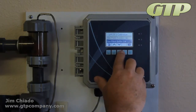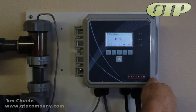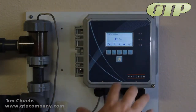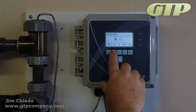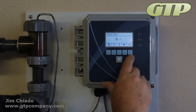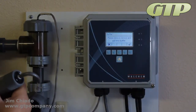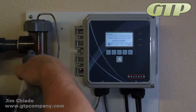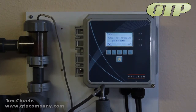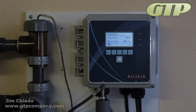We're going to do a one-point buffer. Hit return and disable the controls — I don't want to feed chemicals while I do this, I'm just calibrating. I know this one is 10, so I'm going to make it say 10. I'm going to hit check, rinse it one more time, make sure it's all rinsed, and put it in the 10 buffer. It stabilizes a lot better when it's not in the line. I'm going to press go.